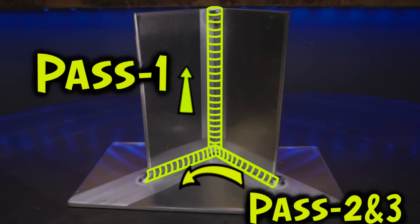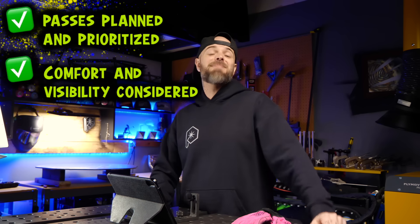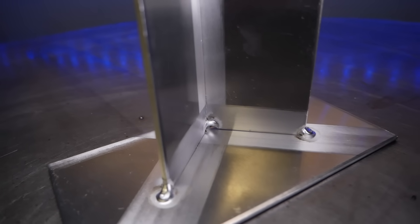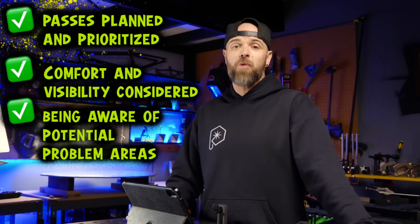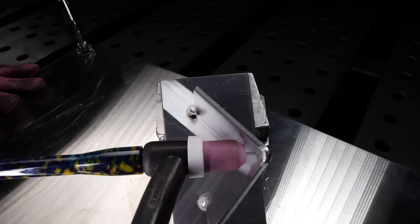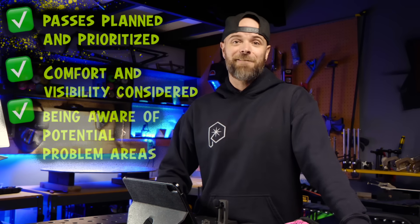You can see that when I finish preparing my actual start, each pass direction has a nice little pocket to either terminate in or leave from. All the edges are blended, no voids or incomplete fusion at this point. Positioning vertically can always be a little awkward — just make sure you have something to run your arm along to stabilize it. I'm using a little block to stabilize my arm so I can weld comfortably, travel consistently, and position myself to see clearly. So do you see why taking all this time to consider everything before welding is going to help immensely? All the hard work before you actually weld is the most important part of this exercise.